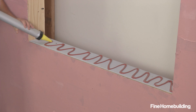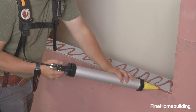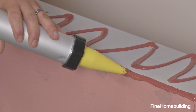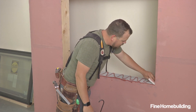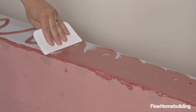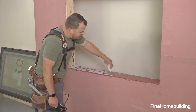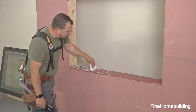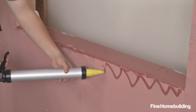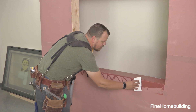I'm not too concerned if I'm a little on the light side, but I am going to take special care to make sure that I'm completely covered. I like to add an extra bead between the sub sill and our cedar sill just to make sure that I'm really making that connection. The idea is just to spread the product to cover the substrate, making one membrane from inside of the opening out and onto the face of the WRB. This joint and seam product works in conjunction with the product that we already rolled onto the wall — it just has a little more body and fiber to it, making things easier to work and connect.